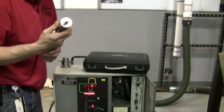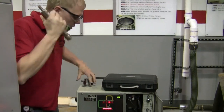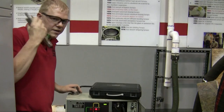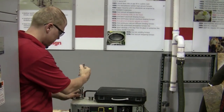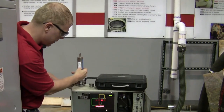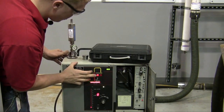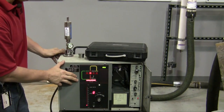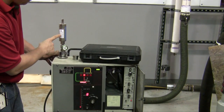We recommend you use a calibrated leak, just to check and make sure it's calibrated. Shake it to make sure you don't hear anything rattling and confirm it's not broken. The calibrated leak is in the 10 to the negative 8 range, so go over there and hit start. Wait till it gets down — it should jump up to 8.2 times 10 to the negative 8.